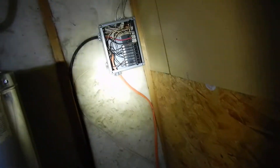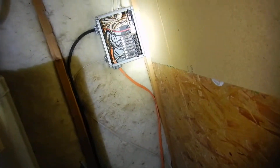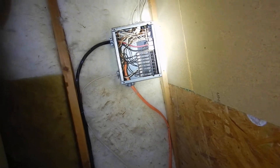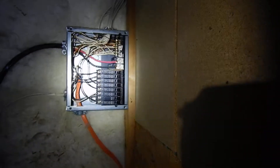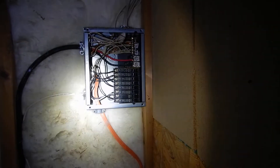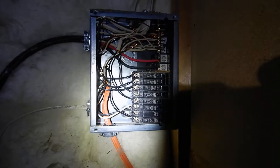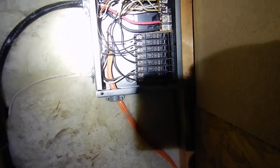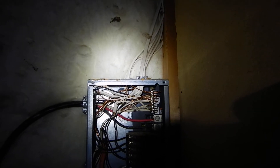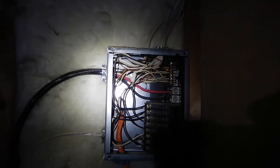This is the upstairs sub-panel — some people call it a third panel. The air conditioning system is a 30-amp system that appears to be properly fused. However, the white hot wire inside should have black tape wrapped on it. If you don't know that's hot, you don't belong in this box. Coming up here, we've got neutrals that are double-lugged. You can double-lug a ground, but you shouldn't double-lug a neutral because they actually carry current every time the circuit is operating.